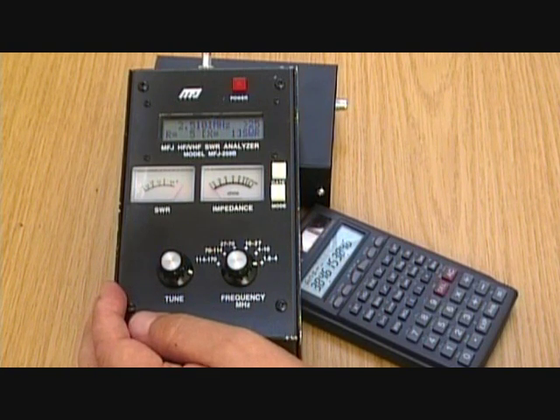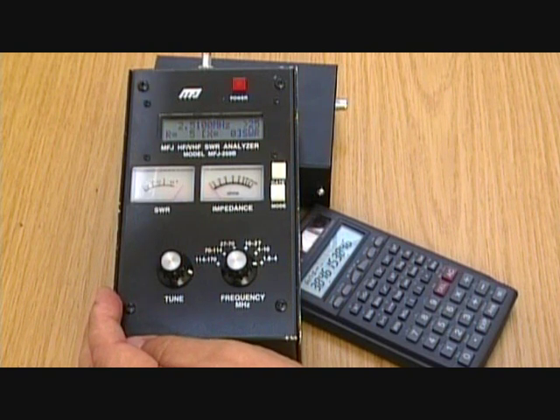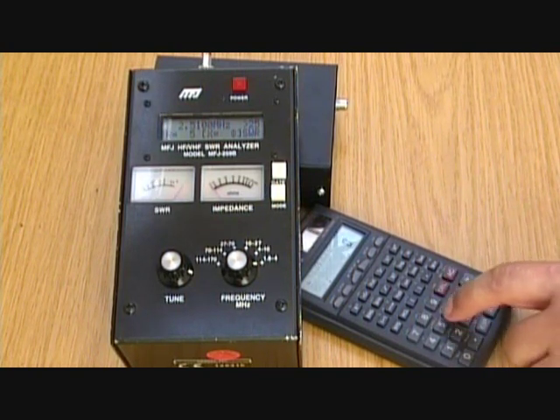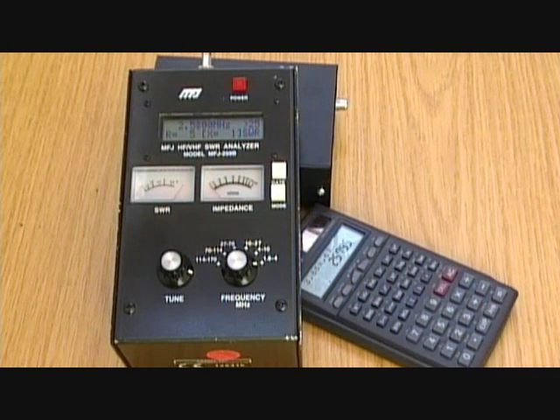The question is: why is that different to the calculated value of 3.85MHz? The answer is the velocity factor of the cable. The electrical length of the cable is much longer than its physical length because of the velocity factor. With this type of coax — most types of solid polythene-insulated coax — the velocity factor is 0.67. So you'd expect the frequency to be 66% of the calculated value. 3.85 times 0.67 is 2.57, which is almost exactly what we've got on the meter. That proves this cable has a velocity factor of 66%. Manufacturers quote this on their specification sheets, and different types of coax have different velocity factors. For exam purposes, remember 66%.